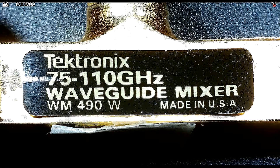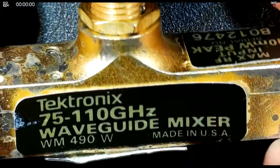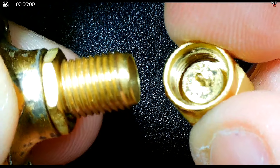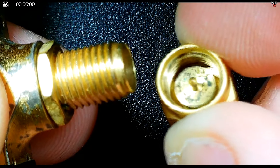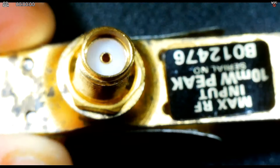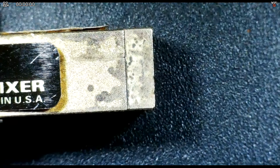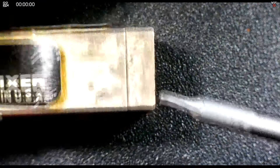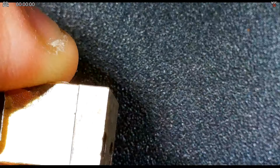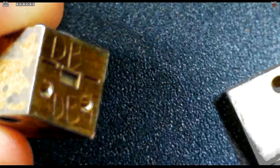Let's take apart the broken mixer. We can see the short circuit cap at the very top — made entirely of metal with no Teflon — which protects the diode from capacitive events when not in use. There's the main SMA connector where we apply the LO. Looking at the end of the body, we can remove the back plate and observe the short circuit — just a simple plate, a perfect reflection. And there is indeed an absorber in there.